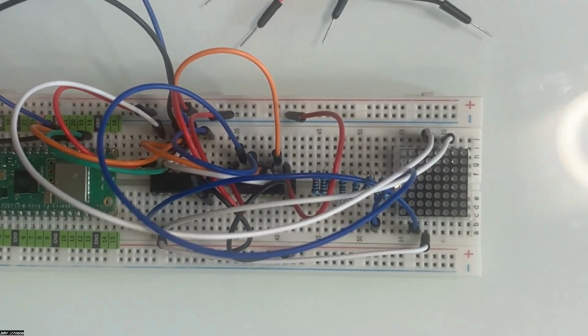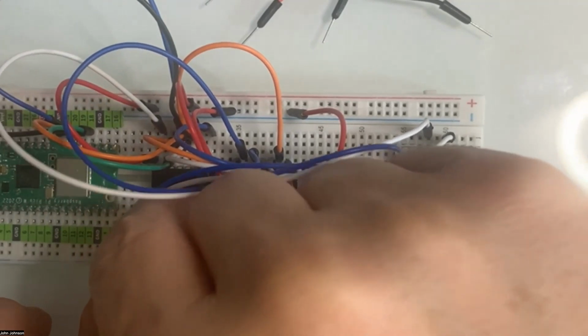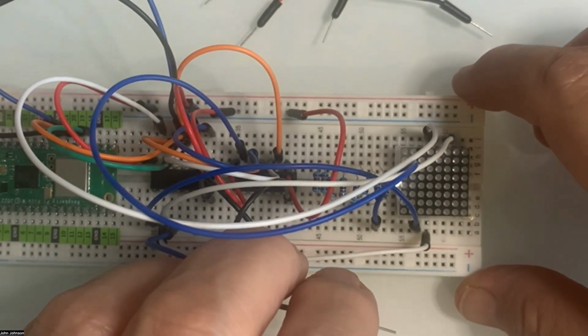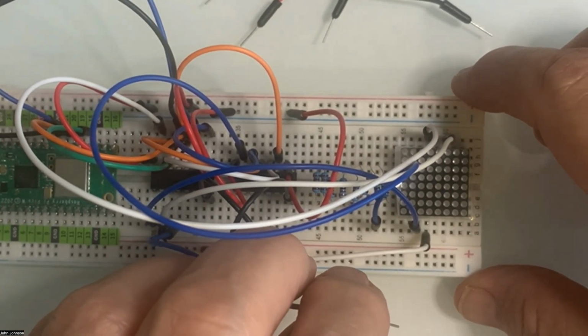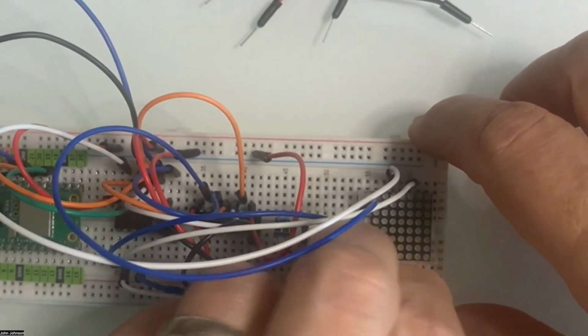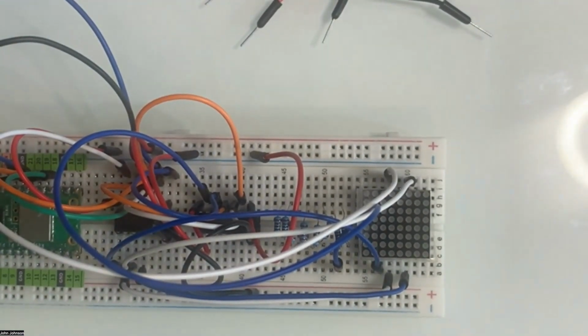Now we're going to go for our fourth pin on the bottom side of the first IC chip. The fourth one is going to go over to the one, two, three, four, five, sixth position, or three from the right on the LED matrix. So we're going to take, see if I can do a red one here, or I'll just do a blue. So let's see, a blue, we'll go from here and put this one into, where did I say that was going? That's going to go over to the third from the right, one, two, three, right here. Again, we're really stretched on that, but I don't know what kind of wiring we're going to have left, so I kind of want to save the longer ones for other challenging things.